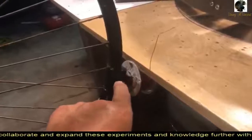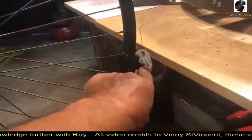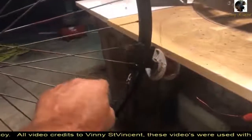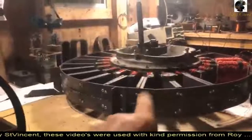Even though this induced current is running into the iron core, running around, it's at its max of how many, I hate to say the word, it's killing me to say the word, how many electrons are induced into this iron core that's laminated, which will probably concentrate more electrons in there, so it's a bigger punch. That's why laminate versus solid core is a stronger magnetic concentration. So that's why I'm going to get rid of these and make laminates that are the same size.